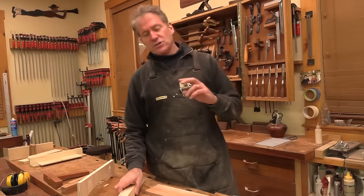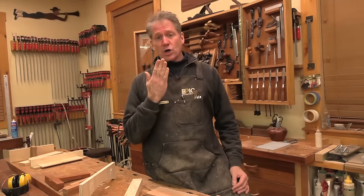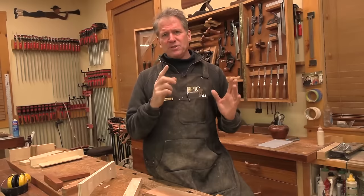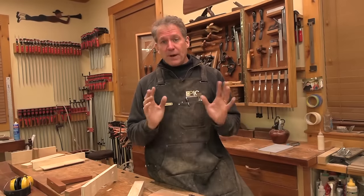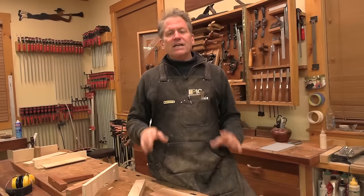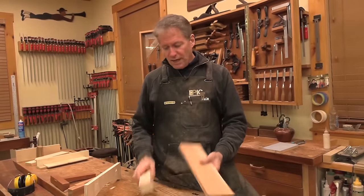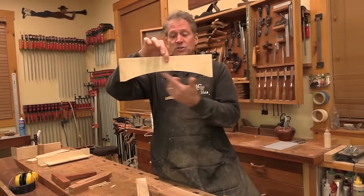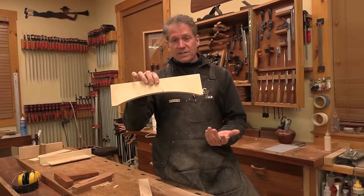This is an especially useful technique if you're doing multiple cuts, pattern work. So you might have a slight curve for a pattern. It doesn't work with all shapes, because you'll see the tightness. If you have really tight curves, it doesn't work as well. But it can do great work for small pattern work. Just see the technique and maybe your imagination will remember this. Let's just say you wanted to make an arc in a lot of pieces. Let's say you were making some arch doors and you wanted to get that radius cut quickly.